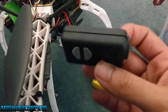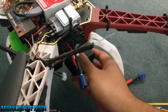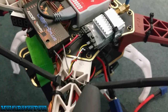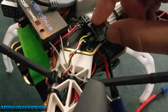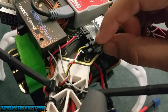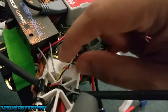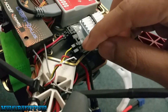So what I did was I had this connected on my gimbal along with my video transmitter, the TS321. There are a few ports on here — the wider one has the first two leads for left and right audio, the third one — the yellow — is for video, and the fourth one is for power. That's this red wire right here, and I highly recommend you do not plug this in, because that's actually 10 volts positive.